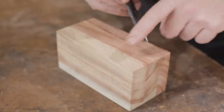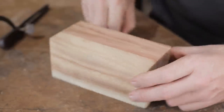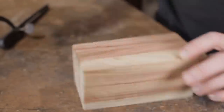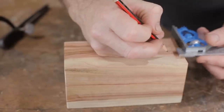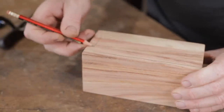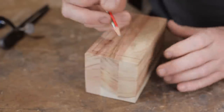I've set my dividers to a tenth of the width of the block, and that will now become the thickness of all the pieces. I'll still mark it by hand — I'll put my pencil in that divot — and for the table I'm going to make it a little bit wider on the end, so that will be about a centimeter. I'll just mark there, same the other side, and as we did the last one we'll just round those corners off.